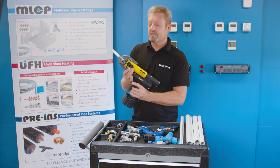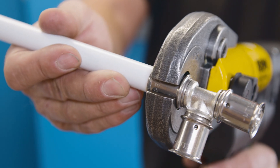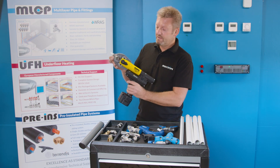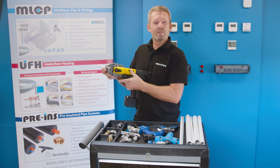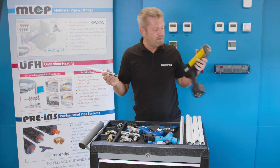It's important that you locate the pressing jaw onto the fitting so that it's nicely sitting between the chamfered edges. Then we're just going to pull the trigger and make the press. Once the tool is reseated on its chamfer, we can remove the pressing gun from the fitting.